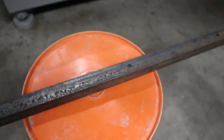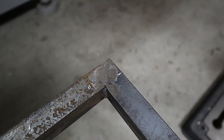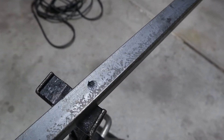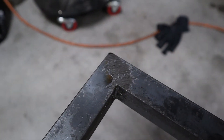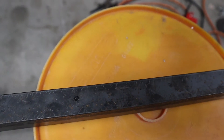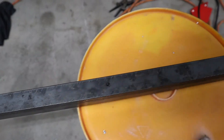Another way to kind of cheat: these are quarter inch, quarter-twenty it says. So I'm going to go ahead and drill these probably like five-sixteenths, just so I've got a little bit of wiggle room. Hopefully that's enough so that if everything doesn't line up quite perfect, there's enough wiggle room to make everything sit nicely. We've got some marks there — they might work, we'll have to see. That one I don't think I got in the corner. Some of these look like they got smudged. I didn't get enough grease on them. So I'll center-point the better ones and use those to extrapolate how far away from this side I need to be, then use the surrounding holes and line everything up.